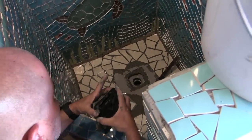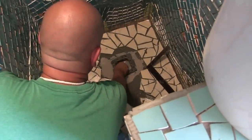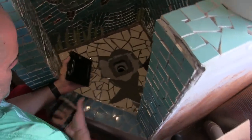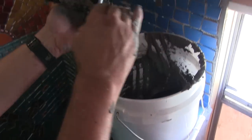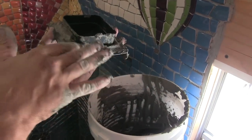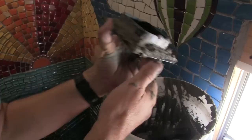We're getting the drain level with the rest of the tile. You put mud in, then push the assembly down — you can see it starting to mush out at the sides. This thinset is horribly drying to your hands because it's so caustic, but sometimes you just have to get the job done.